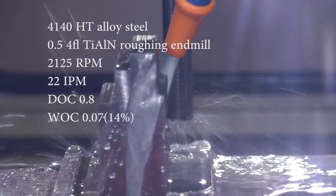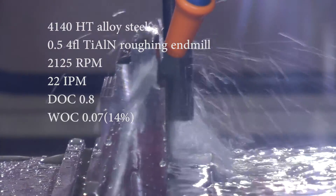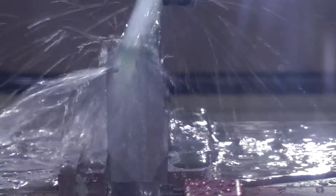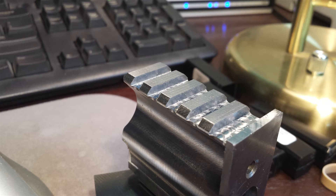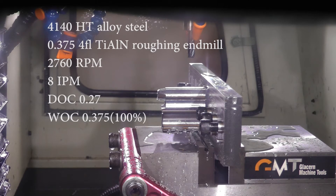Carl at Lakeshore Carbide came back with another suggestion to try to eliminate another Z-pass, and to do that I'd have to take a depth of cut of 0.8 inches. All the other parameters are the same but the depth of cut is greater, and that seemed to handle it fine just running a lateral pass. When I actually get to machining a gas block with that parameter I might have to slow the spindle speed down to eliminate chatter, although I didn't really hear it on that straight pass. There's the finished rail portion — that concludes the top portion of the gas block.